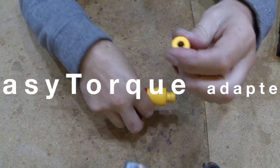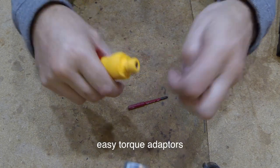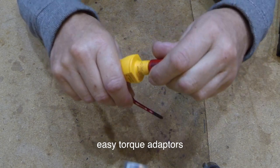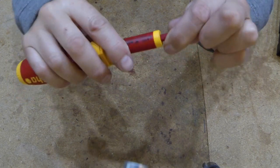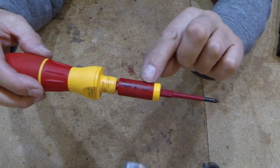The bits are very quickly interchangeable. You have these torque pieces — there are various torque pieces, and all these bits you can individually get from the Wera website. The torque piece will set in settings, so basically what that means is this thing will actually — turning it — just ratchet out at the required setting. So this is set for 2 Newton-meters.